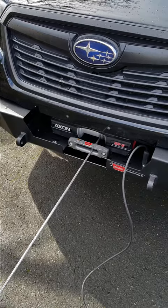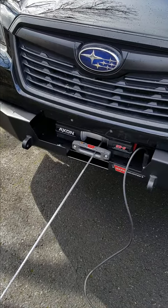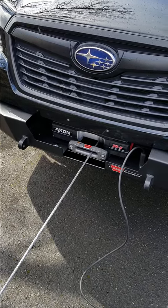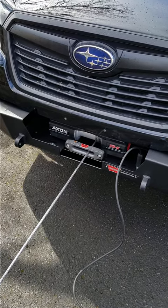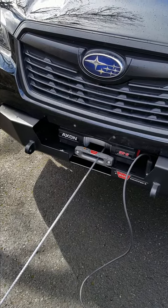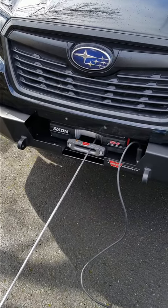What this does is it allows the bottom layer to be tight on the drum, so that way you have optimum pulling power — the drum won't spin in the rope. It just works out better; you actually get a little bit better lay on the drum itself when you get up into the higher wraps as well.